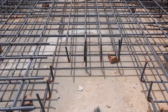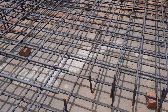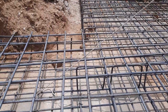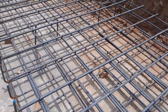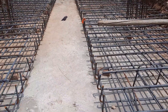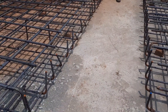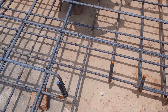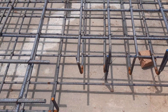On the other side, you can see the concrete cover provided is 75 mm or three inches. You can see the chairs. The chair spacing should be up to one meter, but unfortunately the spacing here is up to three meters — this is the second big mistake. The chairs should be placed closely in raft foundation steel reinforcement to maintain proper spacing of the main bars and distribution bars.